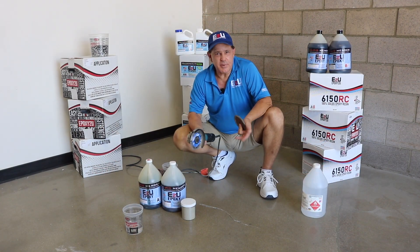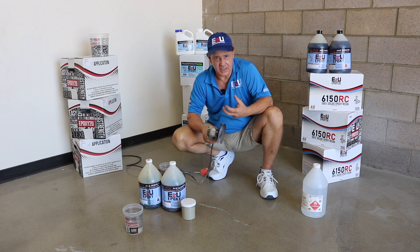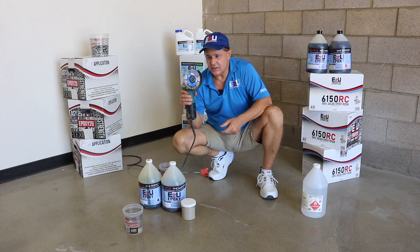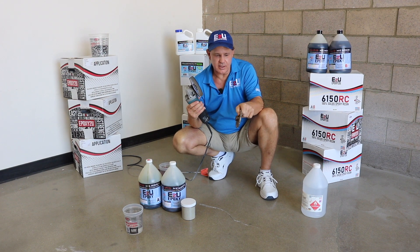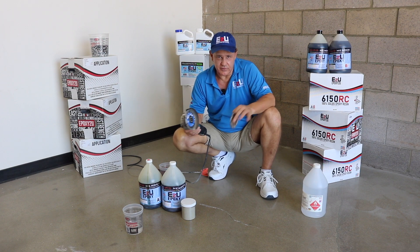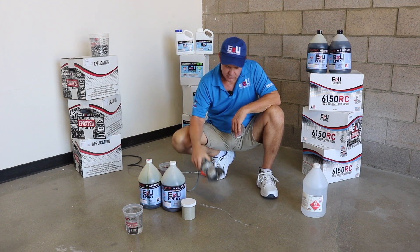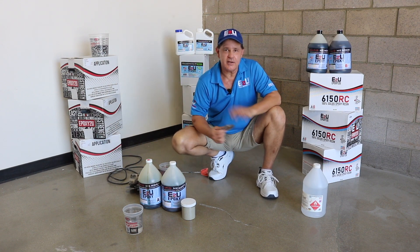Like most epoxies and sealers, this product operates on achieving a very good mechanical bond — it has to be able to penetrate the surface. It's got to be clean and porous so it can seep into all the pores and caverns and get a very tight bond. The tools we use are an eighth-inch wide concrete cutting blade or a v-blade, generally used for opening up joints — you bevel on each side to clean out dirt and debris. Any cracks barely a credit card width wide or larger need to be opened up with this tool. It will profile the sides; just chase it out, vacuum it clean, and it's ready to go.